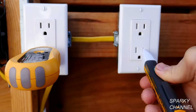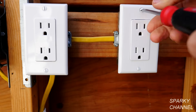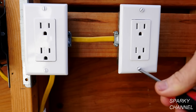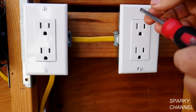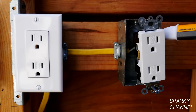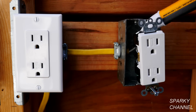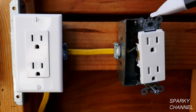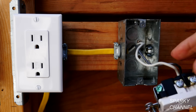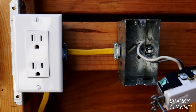All the testers agree that the circuit breaker is off. Now we'll remove the wall plate from the receptacle that has an open ground and remove the receptacle to see what's going on. I've loosened up the receptacle and I'm going to use my voltage detector to check for any hot wires in the back of the box — and we see that all the electricity is indeed off. We pull this out and we see that there's a neutral wire and a hot wire, but there's no ground wire. That's our problem.